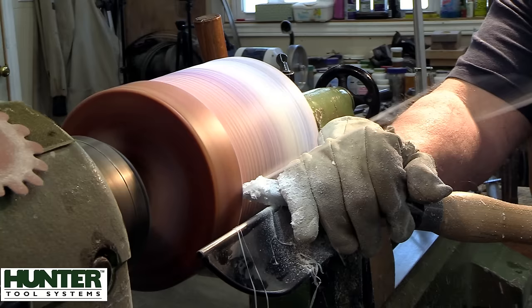So one of the things that I didn't show on here, due to the length of this video, was the fact that on the side where the UV resin meets the wood, if there was, say, a little gully, the UV light didn't fully penetrate that and solidify it. So there were only about three or four spots on this piece on the side where I had to reuse the UV lights just to cure that resin up. And again, I left it there for 10, 15 minutes and I never had any issues afterwards. But I do know that curing UV resin when it's heavily tinted like it is and deep like it is can be a problem. So just watch out for that.